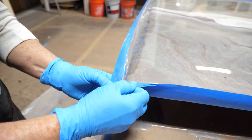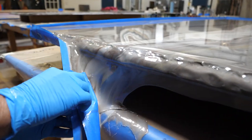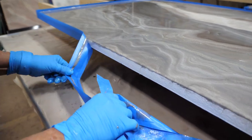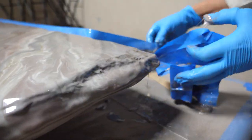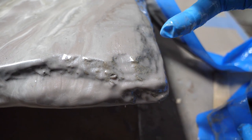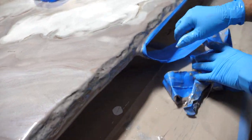We let the epoxy set for about an hour and 15 minutes. Now we're going to pull the tape — this is my favorite part. When I pull, I like to pull down so that I'm helping the epoxy to kind of run over the edge. This edge is just at a 90-degree angle because it's going to be against the wall, so I'm not worried about how it rolls over. I'm a little thin here so you can actually see through to the rock edge, which I really like because it makes it look more realistic like a real rock. I'm not worried about the coverage because I'll be coming over with the ultimate top coat to protect that edge.